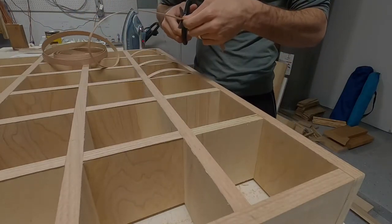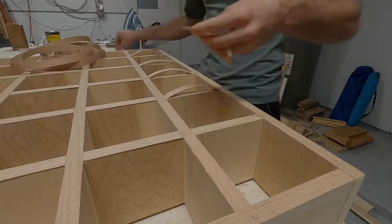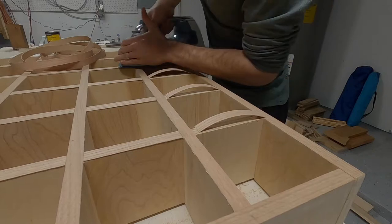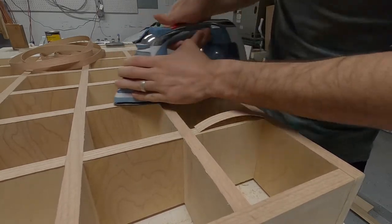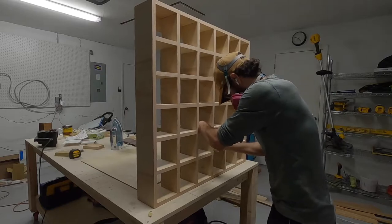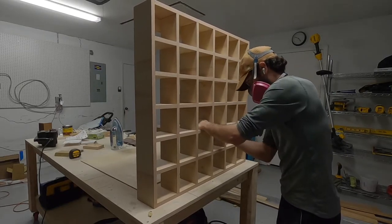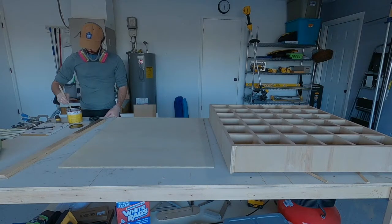For the shelf sections, I had to make sure I was cutting the banding square to fit between the two vertical pieces. This will also end up covering any of the dado joinery, if that's the look you're going for. Now I'm just doing the final sanding before stain. I used Minwax oil-based espresso stain.